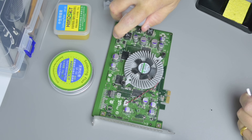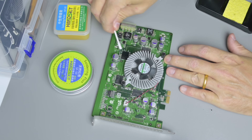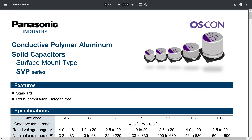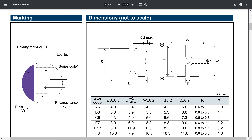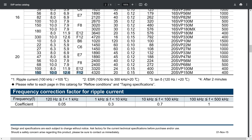And now we get to the fun part — trying to repair this PhysX card. The first step was sourcing the replacement capacitors. They're labeled SVP series, so I did a quick Google search and found a datasheet. The capacitors are from Panasonic. There are only two types of capacitors on this card: one rated 4 volts and 560, and the other 20 volts and 150.